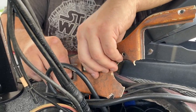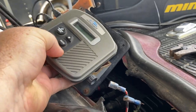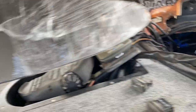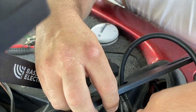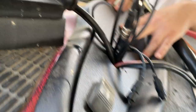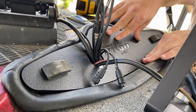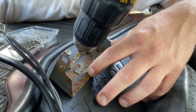We're not going to dive in super deep on the wiring, pulling switches out, or any real details because every boat is different. The very first thing — you can see we're taking out the old broken wood grain plastic panel from the very front. That's where we start, at the front control panel. We got two switches, a small light we decided not to put back in, and my good old HydraWave. We started by running all the cables for the trolling motor, the HydraWave, the electronics through this little hole. That hole is actually designed for a trolling motor plug-in, but we decided to run everything through it and use it for all the electronics. We just took the plug into the very bow of the boat. From there, it's really just positioning the panel where you want it, screwing it down, making sure you've got the toggle switches, then we went ahead and mounted the HydraWave just above the Triton logo in the new panel.